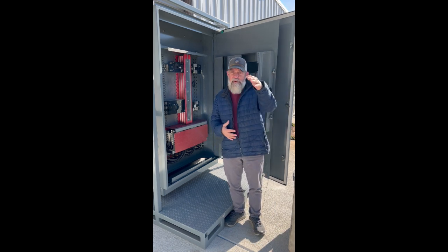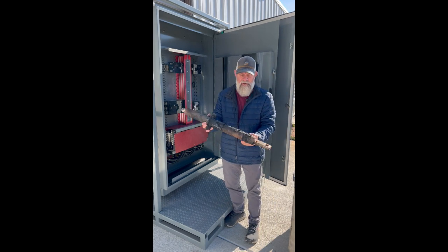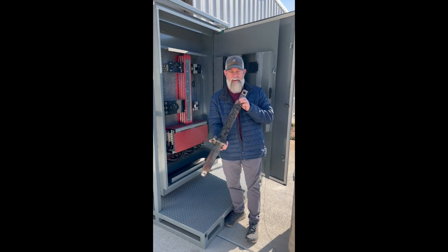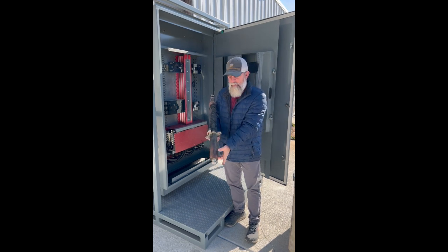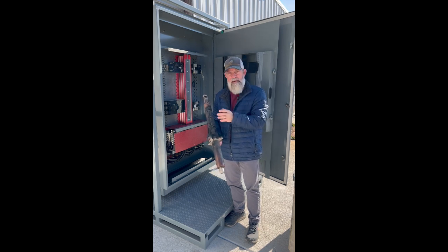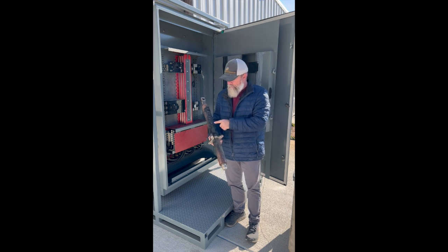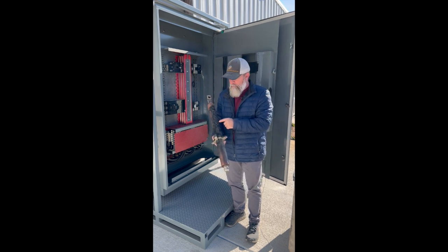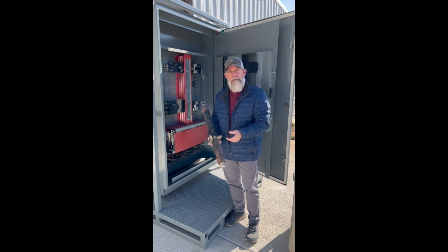Now we're going to look at the really ugly — the granddaddy. This one took a direct hit. You can see where this thing tracked all the way across. This is the insulator portion — there shouldn't be power on this outer sleeve. This was off of a Magna-Blast 13.8 kV medium voltage class breaker. Right around COVID time we had an explosion; they were running around in circles couldn't figure out why it wouldn't work — well, that was our first clue. Poor housekeeping throughout the whole facility — there was debris everywhere, it was very poorly kept up.